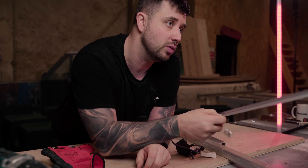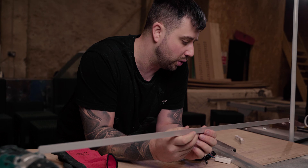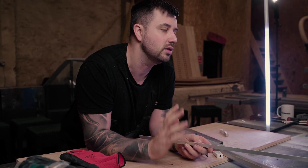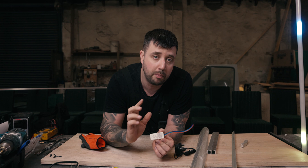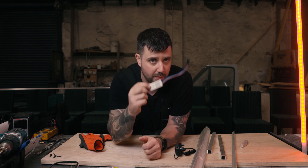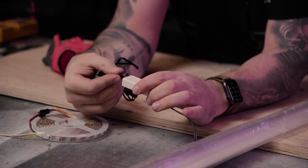If you buy the LED extrusion we have here, you could effectively make five lights from one strip. This, also found on Amazon, is what's called a corner LED extrusion — we're gonna use it to stand upright. For speed, I bought these on Amazon Prime, next day delivery, in one meter sections. The other thing we need is this controller — the SP110E — which can be controlled from your smartphone. The only other thing we needed was a five-volt transformer with a plug to go into our controller.